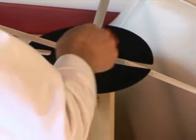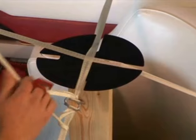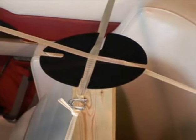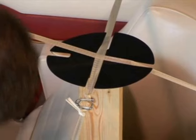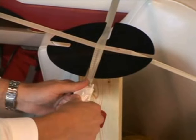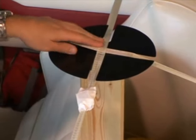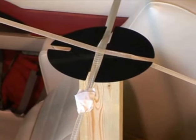Ryan is putting a loop on each side of the buckle just in case it should turn, giving it a little bit of extra durability. Then he will trim off the edges, tape it, and after he staples the top of the pole through the top of the end cap this will constitute the finish of the support structure. Once that is done, make sure you have all your tools taken off the boat. Also make sure that your boat has been winterized — this is a very good time before we actually start putting the shrink wrap on.